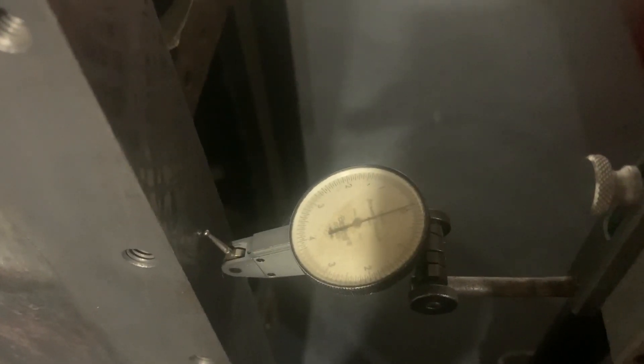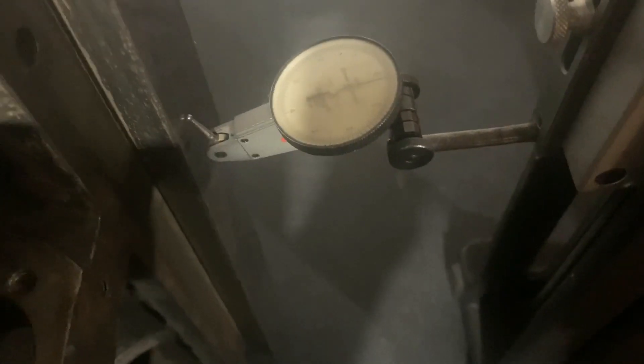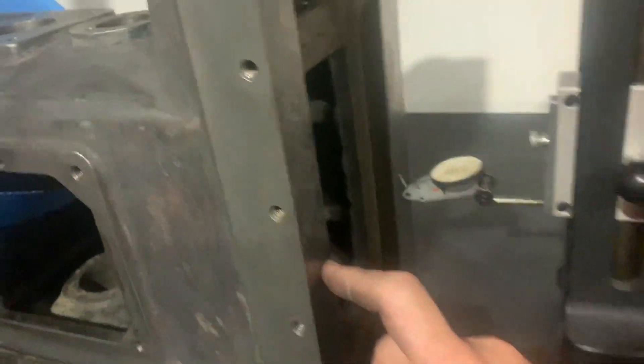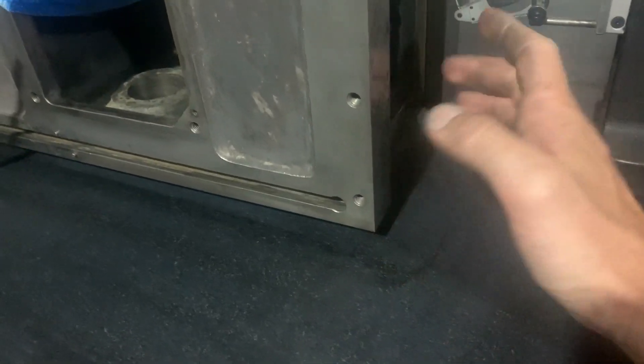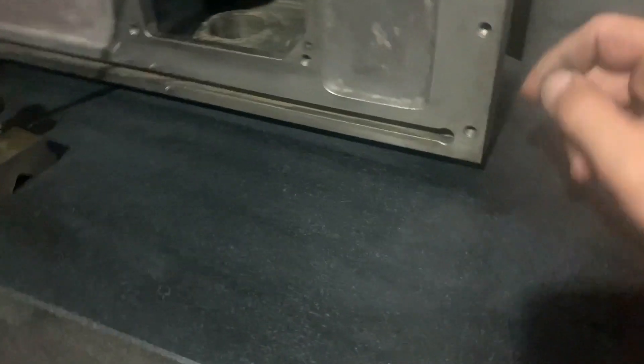We will have very hot — big highs and lows — but looking at that we've got about five tenths up and down all around, which is excellent. The other face dips a bit there. I've got the same, less than five tenths. The worst wear is probably down the face here, but they're just very evenly worn — the factory scraping is gone. There are very light remnants of factory scraping on all faces, so the wear is just very, very even.